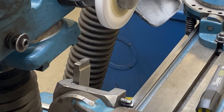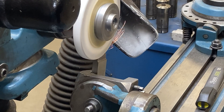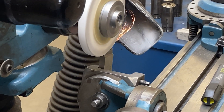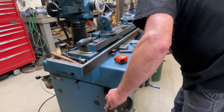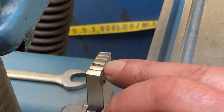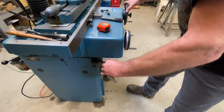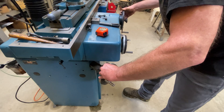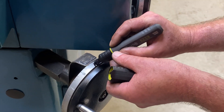You can still see some wear there so I'm going to keep going. Now all that damage is gone - you've got a nice fresh cutting edge there. I'm going to take my marker and put a mark on my down-feed handwheel. I'll come to a line and put a mark on that line, and I'll bring all four of the tools in this set to that exact same place - that way I know they're going to cut evenly and properly.